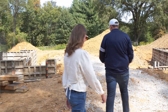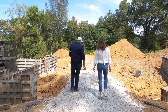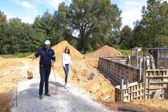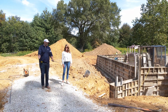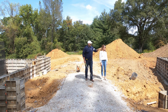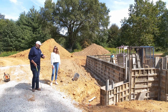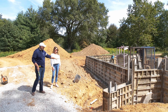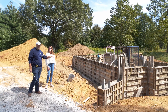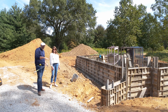We're walking through what will be the driveway area. We've got these cool decorative wing walls on either side of the garage. This lot was graded lower here, so we have a five-foot wall right here on the garage side. We'll fill that all with gravel — we prefer gravel over dirt so you won't get any settling. If you do dirt, it rains and you'll get about 30% compaction and it'll settle over time. With rock, it stays solid.